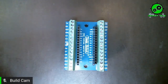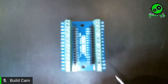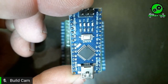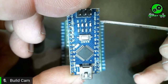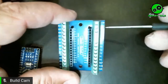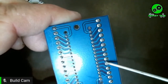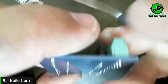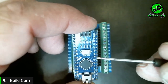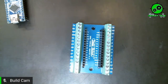If you see here on your Nano, all your pins are labeled. You can see where it says VIN — that's the power in — and then this is your ground. That all actually matches what you have on your terminal board, so these hook together. When we're talking about pin out on your Nano, that's what we're talking about. If it doesn't match, you've got the wrong board.